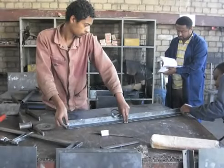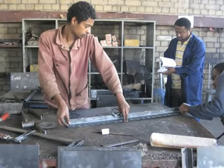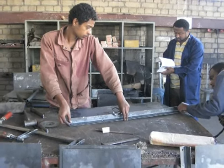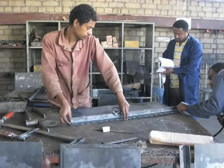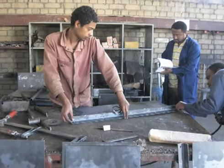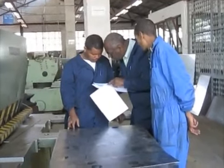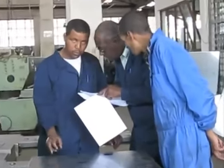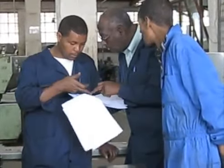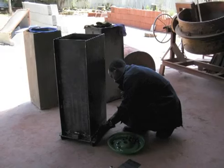Before we get going, there are a few tips that we have for you. The first time you have a mold made, book 1 week of time to work directly with the welder, or check in periodically to make sure they understand the instructions. Don't expect to simply drop off the plans and come back to pick up a finished mold. Explain to your welder what the mold is for and what the most critical parts are. If the welder doesn't know what the part does, they won't understand what's necessary to make it work. It's always a good idea to show them pictures from the manual or this video.